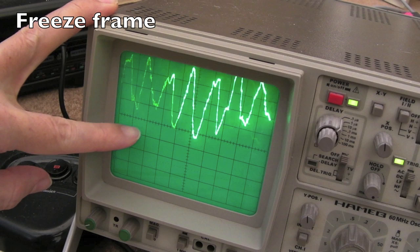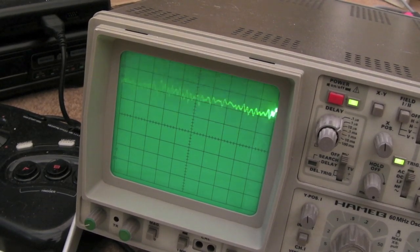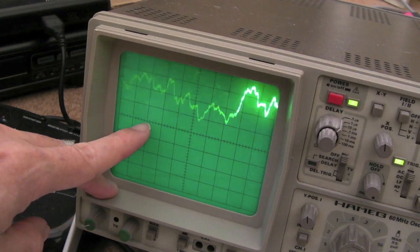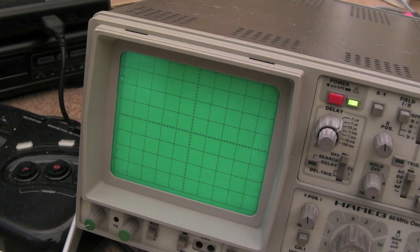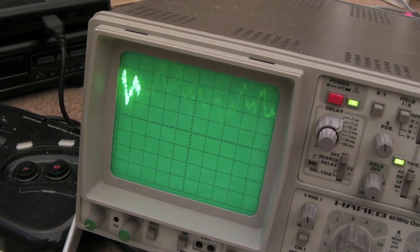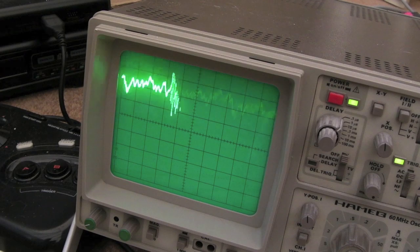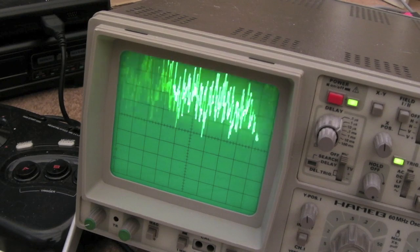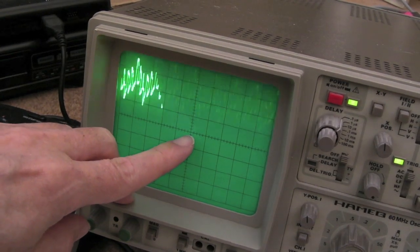Can you see the little dips — little peaks just hitting that? When the volume's super loud there — I'm playing Lotus 3 here, by the way — you can see just little peaks going under the negative line there. So it's a really super, super minor problem, which is kind of what I always expected, to be honest. Because it's not like these caps fail within six months of the machine going into service — they don't. They last years, maybe even a decade or more, before they start to leak. Out of the 500 boards I've replaced the caps on — I've got six boards here — I would say two of them had one leaking cap each on the audio side. I've seen the same thing on the 2000 boards: out of three 2000 boards I've got, two of them had one leaking capacitor. We are hitting the negative side here — it is dipping just a little bit.